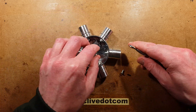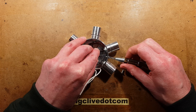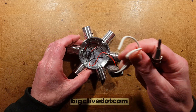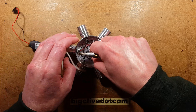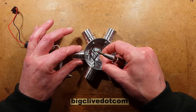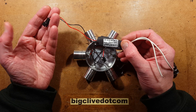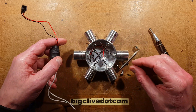I went to get my favourite LED head torch and found it was flat. It wasn't really taking a charge, so I opened it up and found the battery inside - a very high capacity and high current output lithium battery - was surrounded by mould. That's going to make an interesting video. Anyway, here is the light. It plugs in with this little connector, which means you can change the power supply - that's good. The LEDs are all connected in series: red going to one, looping through with brown wire into the next, all the way around, coming back to the black wire. The power supply is in the heat shrink sleeve; I prefer a plastic enclosure as this feels like it would trap heat, but we'll open it in a moment.